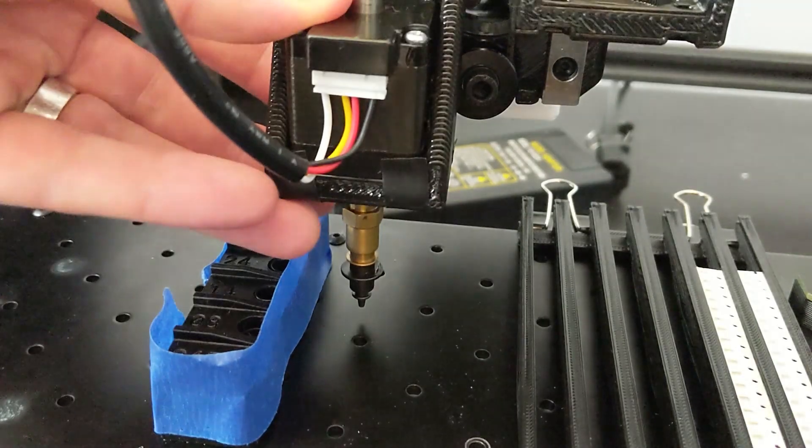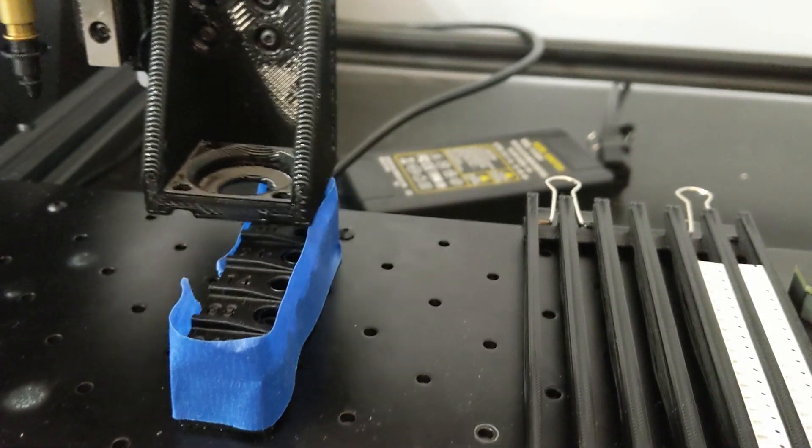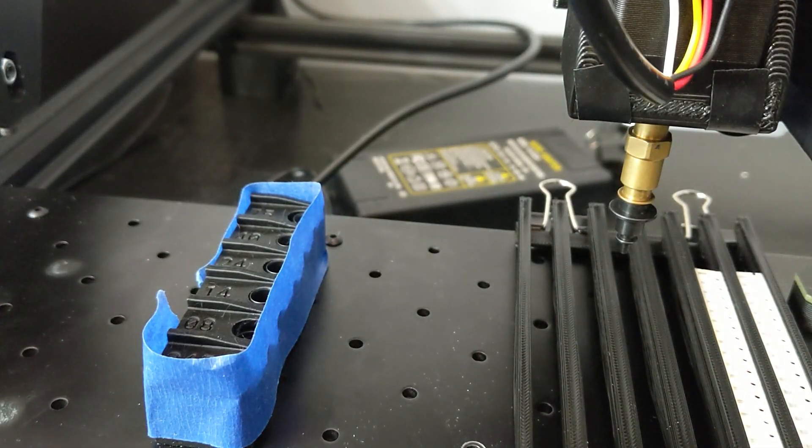But I found that even with the holes, it was still hard to place things. I ended up having to move the pick-and-place head nozzle swapper over to the left. But then when I did that, in the future, when I add a second head to it, I wouldn't be able to have the second pick-and-place head come in and do the tool change because it was too far over to the left.